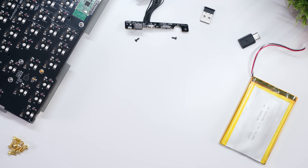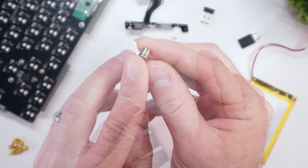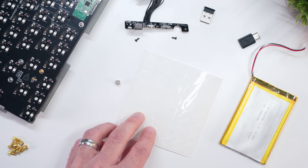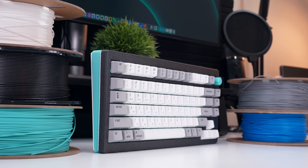To begin, in addition to the V1 Max — from which we take the PCB plate assembly, daughterboard and screws, battery, case screws, and radio frequency dongles — we also need four small magnets that are 6mm in diameter and 1.5mm thick, and four adhesive feet. You'll also need at least 356g of PLA and 53g of TPU.